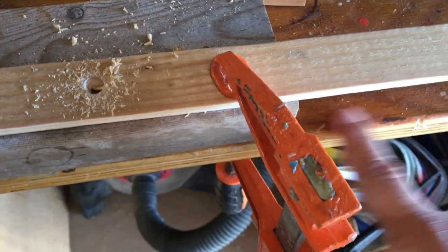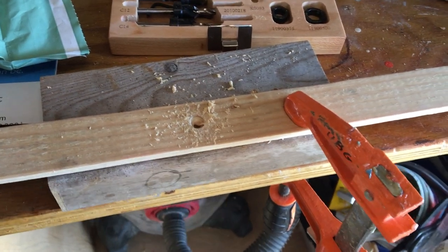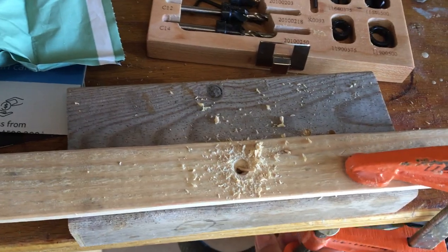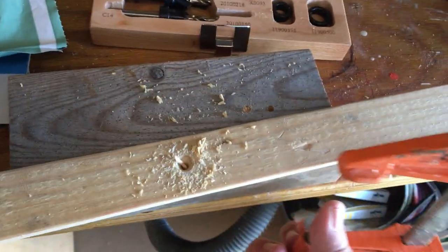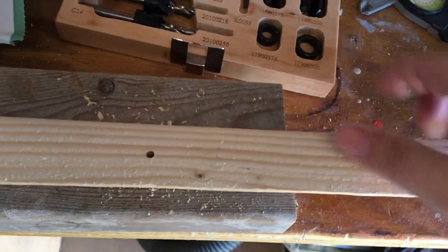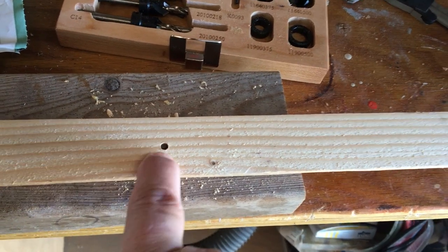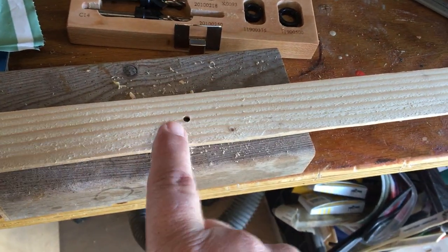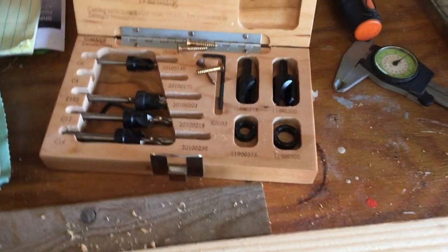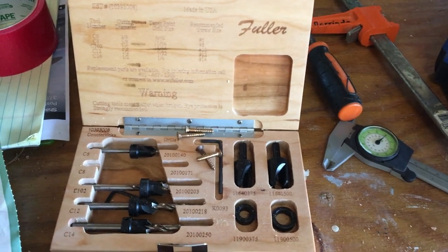One of our little tips: I don't want to drill a bunch of holes into our little bench, so we just put a little sacrificial piece of wood underneath. That does a couple things — it keeps us from drilling into the bench and having a million holes in it, and it also gives you a nice clean hole on the back. If you just drill through with nothing under it, you'd have all kinds of splinters and wood flying out, which would make it hard to fit to another piece.